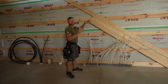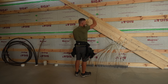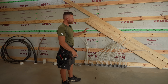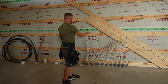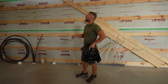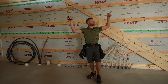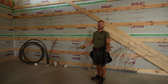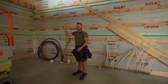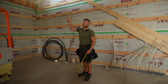I don't want to be under here working with a staircase over my head — dark, hitting my head and all that. So we're not going to build the staircase until the mechanicals are done for the most part. Our first step is to get the headers all located and built, then come down and build the walls underneath. I find that easier than standing walls and setting stuff on top, because when things aren't perfect down here, they won't be perfect up there.